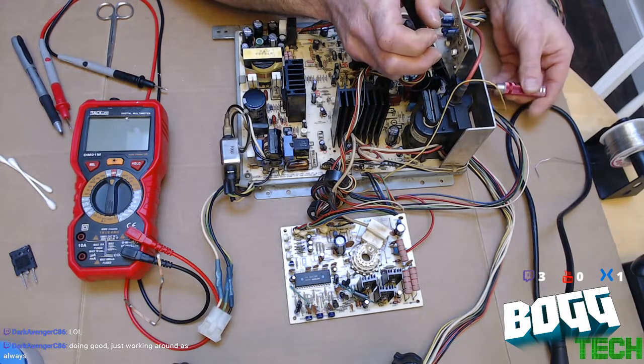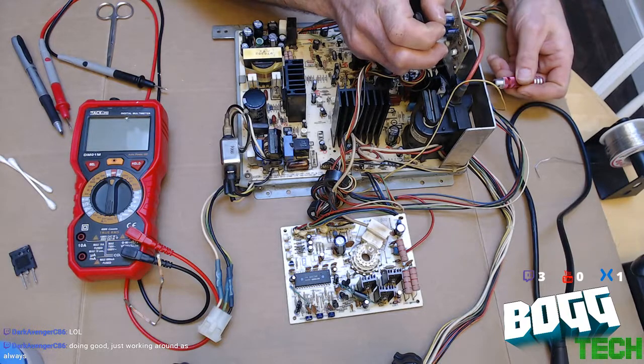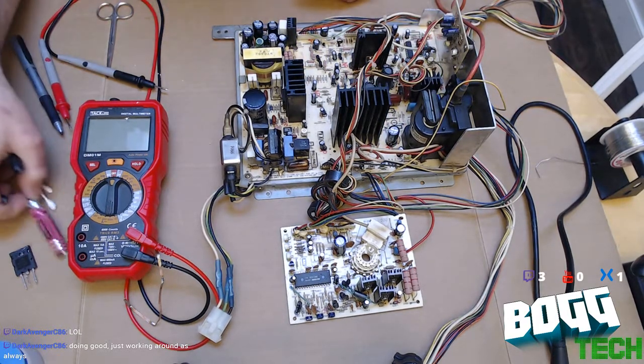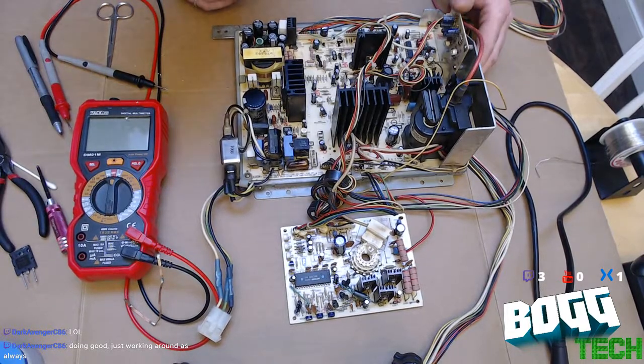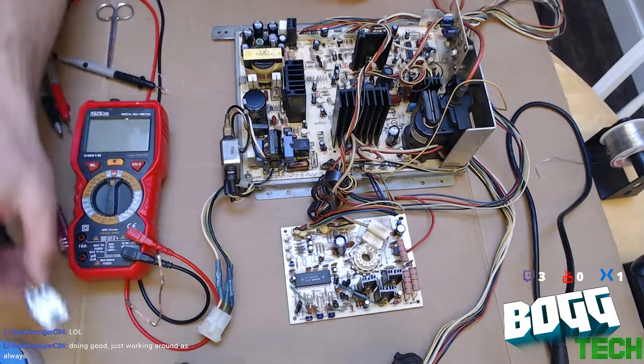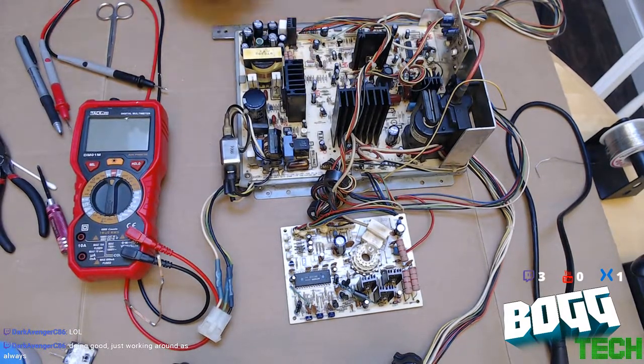Now, if you were screwing down a transistor like this into a heat sink like I am, don't over tighten, or you'll break stuff. You don't want to crack the transistor. I'm mad at you. BU2532AL. Don't think you're a counterfeit. Okay, that's in place. Now we can flip it over and solder it together.